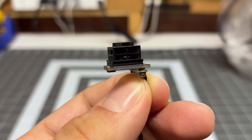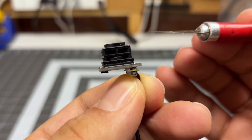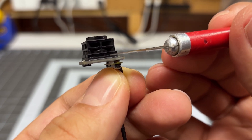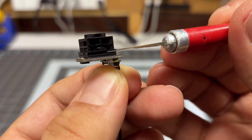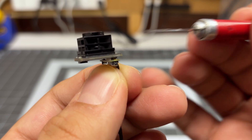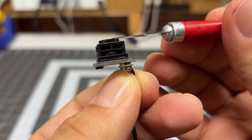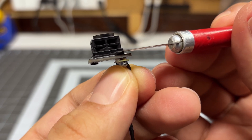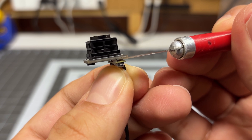The first step of the modification is to get off the original lens that comes with the camera. You can actually see where the camera lens and the image sensor join together — there's a little tiny bit of a crease and a gap where I have my knife right now. You can see the glue the factory used. From where I have my knife down to here is the lens; below that is the actual image sensor.